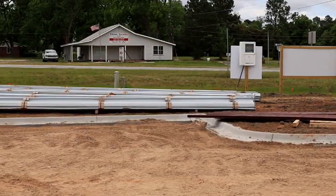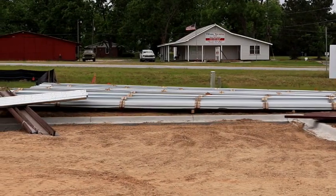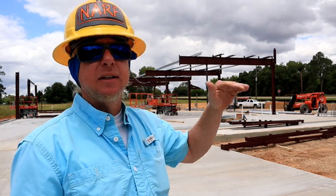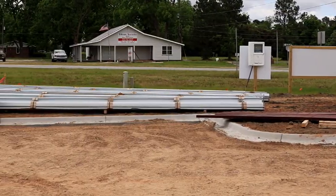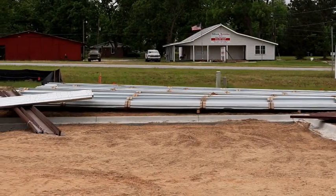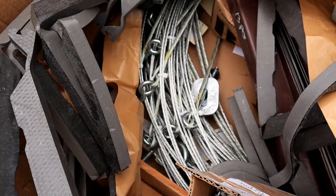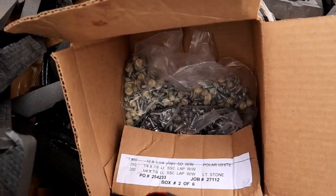My roofing metal I'll lay out to the edges a lot because that's going to be one of the last things. On this particular job I'm going to have masons come in — they're going to run the wall before I even start the roof, so I don't want to stack it next to the slab. Where I would stage it is on this end and lift it up on the roof. When it came off the truck, just to stay out of the way, we set it out by the edge of the road.